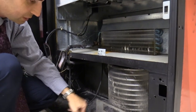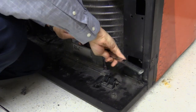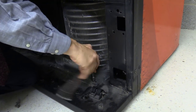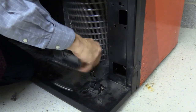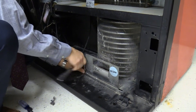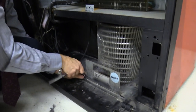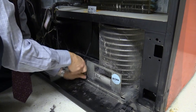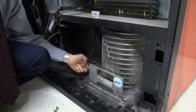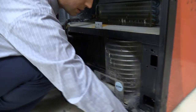On the actual deck itself there are just two 10-millimeter bolts. Use your ratchet, get them loose and remove them. Put them aside because the new deck does not come with new bolts — you have to reuse them. This one here is a little dusty. If you let these things get too dusty, that's going to shorten the life of the compressor. You should try to get in here a couple of times a year with a stiff brush or vacuum to get all that dust out of there.